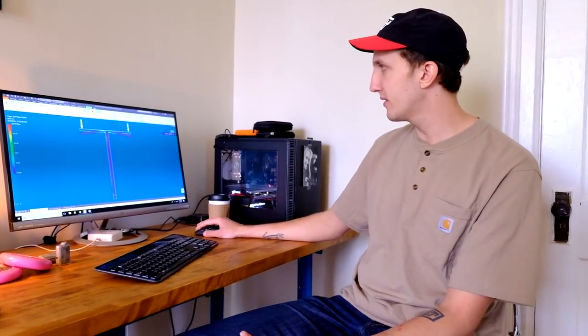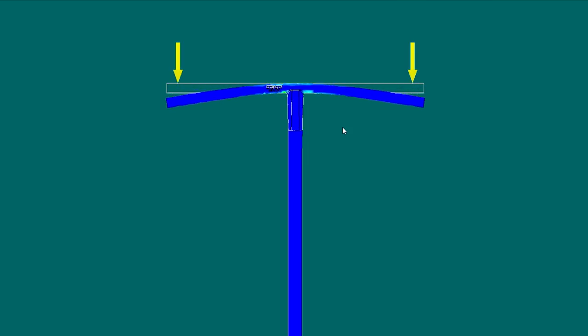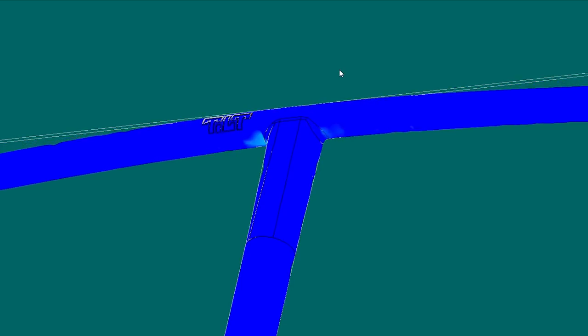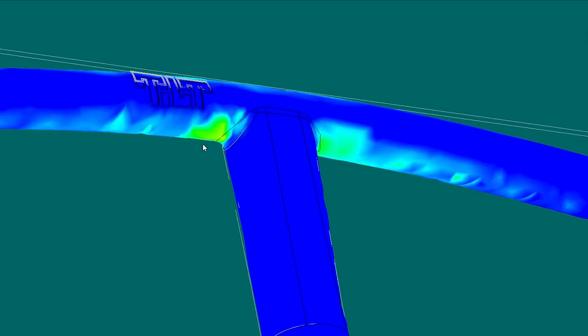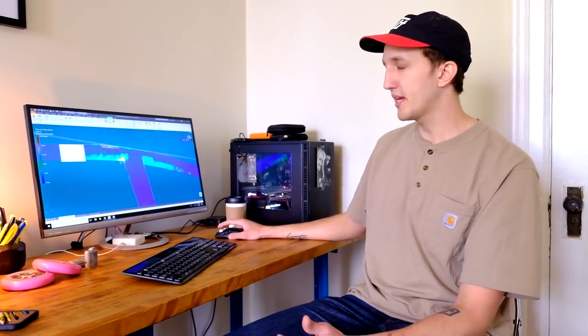If we run a simple animation of the kind of force you would be experiencing on the handlebar when you land, we can see that the handlebar wants to bend down obviously. But what this shows us is that the weakness isn't along the top of the bar — the weakness is right by the weld, by the sharp area on the weld. If you make a handlebar and you don't do the appropriate heat treating around the weld, that's a really big issue.